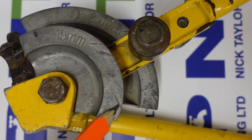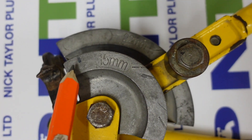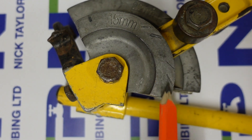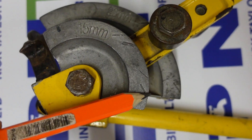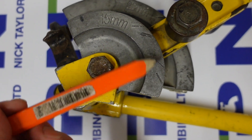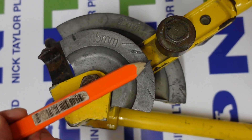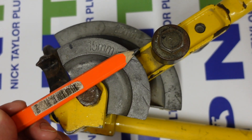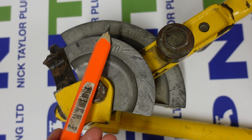This one here is a 90 degree bend, so when you've got your pipe in and you bend it around, that's 90 degrees. If you halve that you're at 45 degrees, and just using those two marks alone you can start to gauge the whole former. So 90 degrees is here, halve it — 45 degrees is there, halve that again and you've got about 22 and a half degrees.